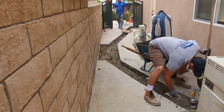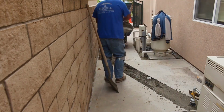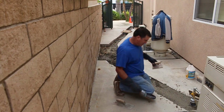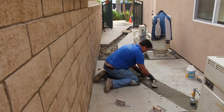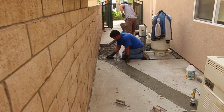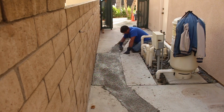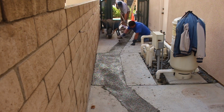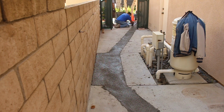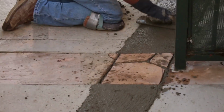So here we are on this shady side of the house. The thing about that is the concrete's not going to dry on this particular side of the house. And for a job this small, you don't want to be sitting on it for a long time just for a small piece. So I mixed my own concrete, using half of the quick drying Quikrete high performance concrete mix, which on the bag says you have about 20 minutes to work with it, and that's not quite enough time. So I went half and half of the regular set concrete to half of the fast setting concrete, and it was all about 4,500 to 5,500 psi stuff. It went off really nice. It was very creamy, and I think I was wrapped up and poured out in about 2.5 hours.